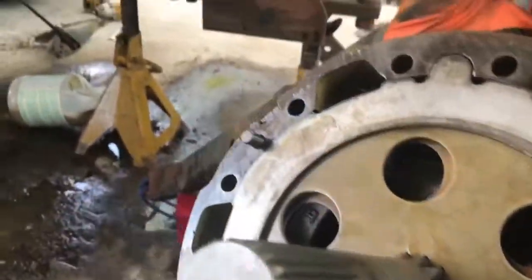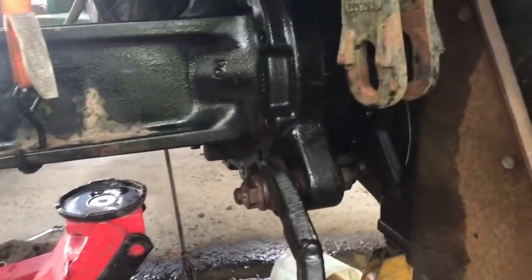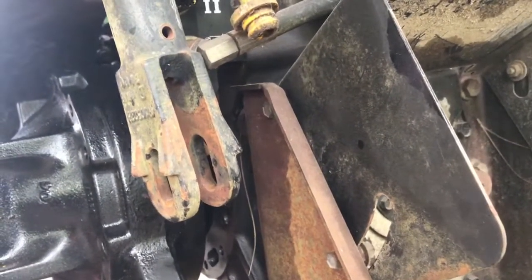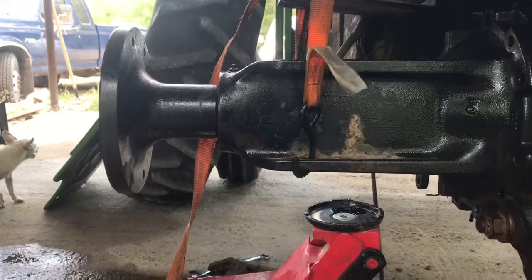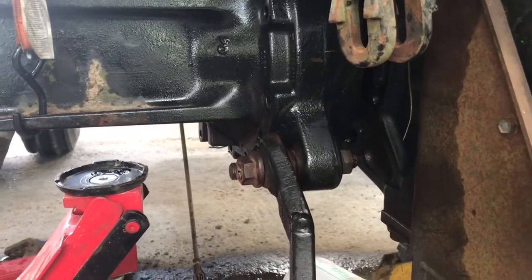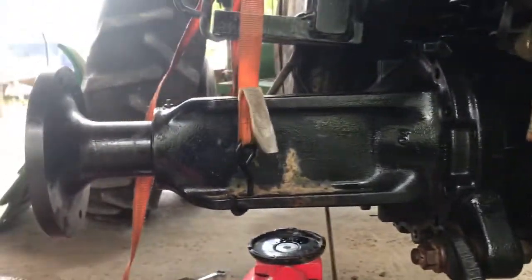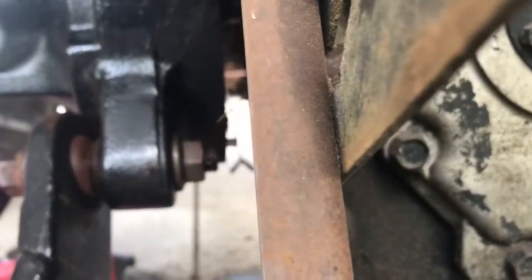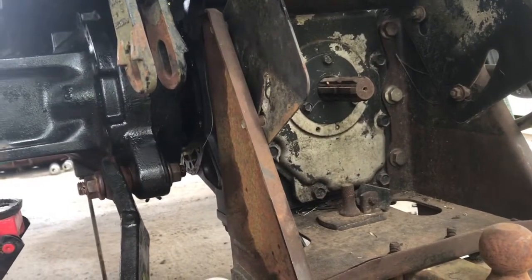There's no gasket between. I use the engine hoist and a floor jack to get it aligned. I got that shaft inside that little bearing. That'll hold it up in place. Then I move my strap backwards a little bit. Now I got to get that jack under the belt over here, get a little 2x4 so it can help take some weight off of it while I wiggle that shaft into place. That shaft's got two pins. There you can see one of them right there, and the other one's over here on top. Those are guide pins, and there's two locations where it goes on the body.